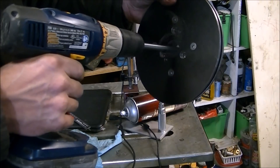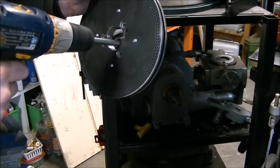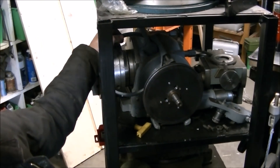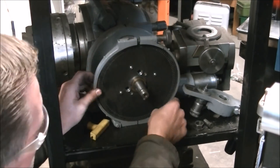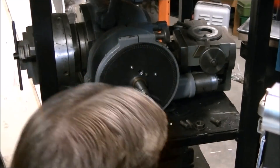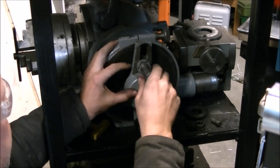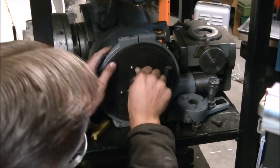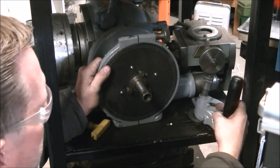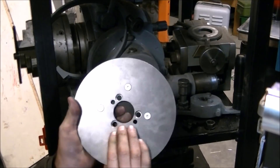The fit was a little tight, so I used the Keith Fenner trick of the little flappy disc sander and worked it a little bit until I got the three pieces to fit together well enough to go over the bore on the dividing head. There's a trial fit-up of the completed plate. The one thing I'm going to need to do is the pointer on the arm won't fit in the holes — the holes on the existing plates are a larger diameter, but in order to fit 127 holes I had to go to a smaller drill size, a number 33 drill. My plan is to make a little sleeve that fits over the end of the existing pointer with the other end small enough to go into those number 33 size holes.